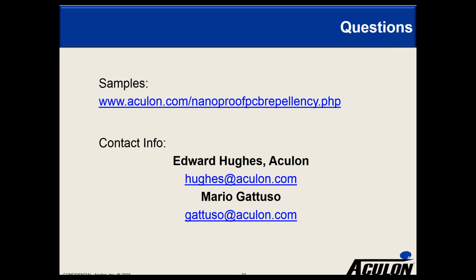Let's see. Next question up is, for NanoProof 5.0, what is a typical oil contact angle? Oil contact angles are what, about 78 or so? Yeah, high 70s. That's what I remember reading. So what would be an untreated contact angle? Untreated depends on the substrate, but somewhere between 10 to 20 degrees contact angle with oil.